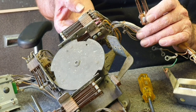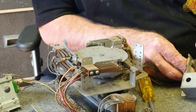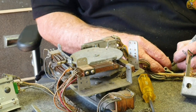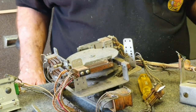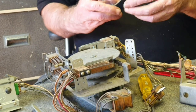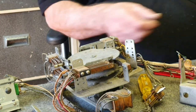We're on cam level B, so I'll put a little 'B' on that tag. It's stack three, so I just put a B on it so we know where it goes. We've actually taken photos of this as well — just insurance in case we lose the plot, especially since we probably won't be getting onto this again until after Christmas. Each of those stacks comes off — it's not rocket science, but putting them back where they came from is the important part. That's why it's important to take photos, and ones without nuts you've got to wrap with tape to hold them together.